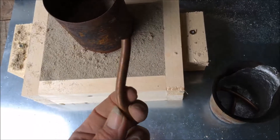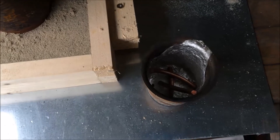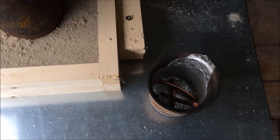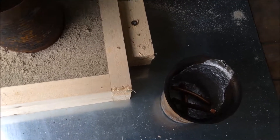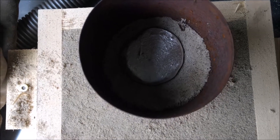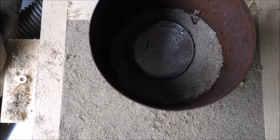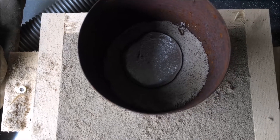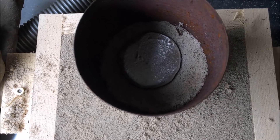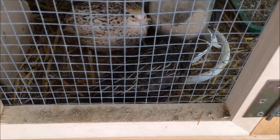I'm not going to be filming it burn and melt — I'll show you the end result, but it's still raining. I've got a percentage of copper I'm putting in it; hopefully it'll melt. My forge I'm going to upgrade if everything goes well anyway. That's that poured — see how it works. I didn't think the copper was melting, but it seems to have mostly melted into it. I'm going to have to work on getting it off; I ran out of coal. I had to refill it twice, but I didn't realise I was going to be in for that much coal. I'm going to break these moulds out and see what we've got.